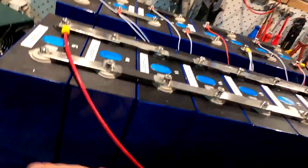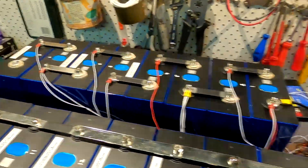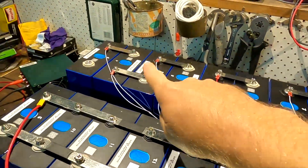This morning I had 3.35V on it, this afternoon 3.36V, and this evening it was on 3.65V - and that's exactly what I set the buck converter to, to fully charge the battery, because we want to top balance everything before we put them in series connection and build the actual battery.